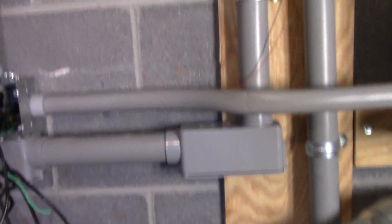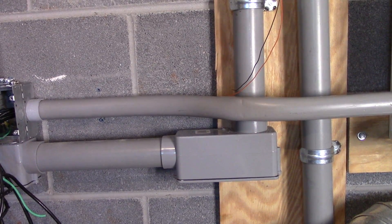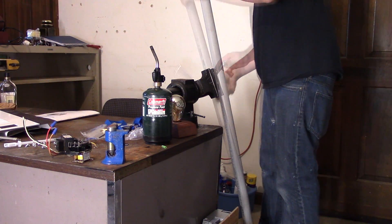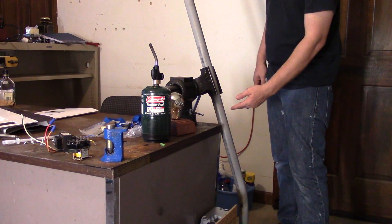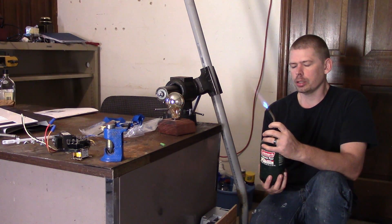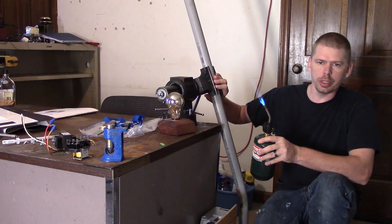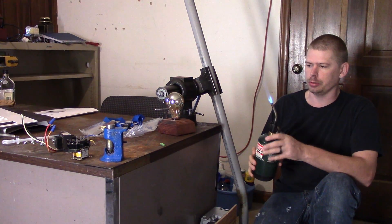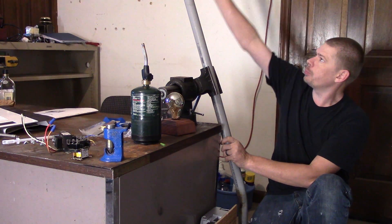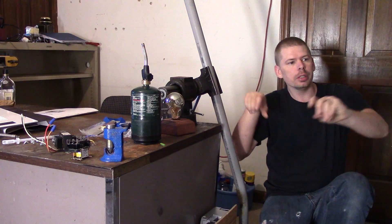You can't buy it like that — you've got to make it like that. What I had done is I took a piece of pipe, like this piece of pipe over here. I opened up my vise, clamped the pipe in the vise, and cut off about right here so the clamp would keep the pipe cooler on that stretch. Then I took my torch, turned it on, and put the torch directly inside the pipe in the center. As long as you put it in the center, it creates a draft and keeps the walls cooler than normal — you'd think it's going to catch on fire, but it didn't. I was able to heat the entire section of the pipe up above the point where I was clamped, got it to heat up, and mold it into the shape that I wanted.